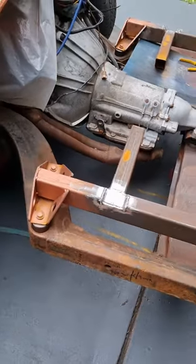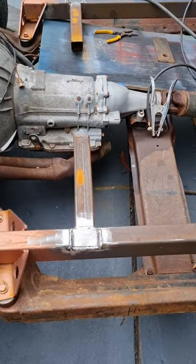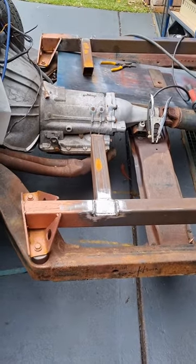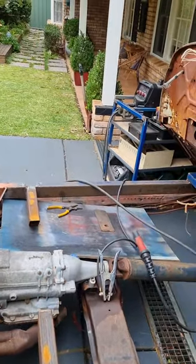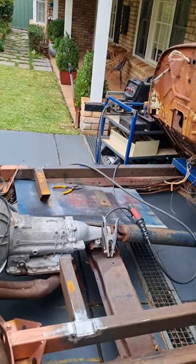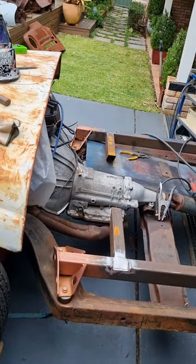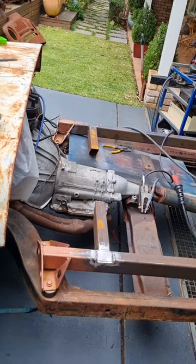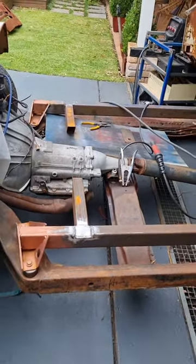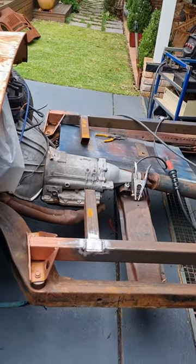Also meant to say, in case you're wondering, it took about an hour from start to finish, including getting the gear out to do those. I've mentioned the welder settings I used before. I pretty much use 0.8 mil wire all the time. It can take 0.6 to 0.9, but I don't bother changing it. I do panel work, and I do pretty much everything with that. If I was doing some really heavy duty stuff, I could use 0.9, and I do have it, but I just leave 0.8 in there. I just adapt to that.